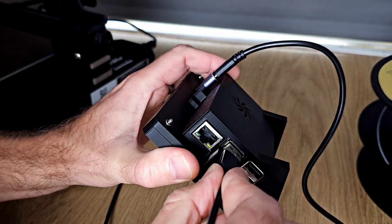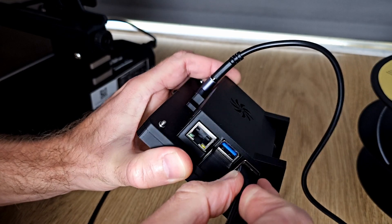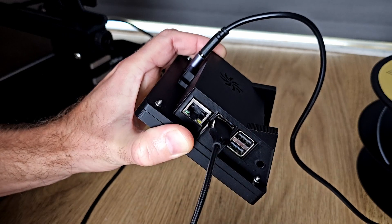If you're sure that you have the right cable, then the next thing to check is that you've plugged your USB cable into the correct port on your Klipper device. If you've been following along with my Klipper series, you would have already told your device which port it needs to use to talk to your 3D printer. If you've since plugged your USB cable into a different port, then you either need to plug it back into the original one, or go and find the MCU ID for the port it's now plugged into and enter this into the printer config file as I showed you in the MCU ID video.